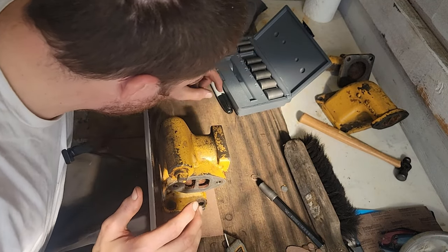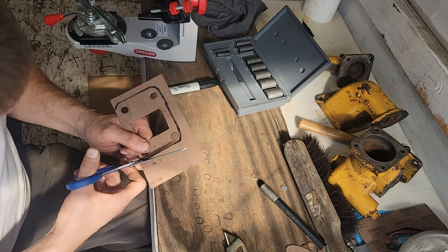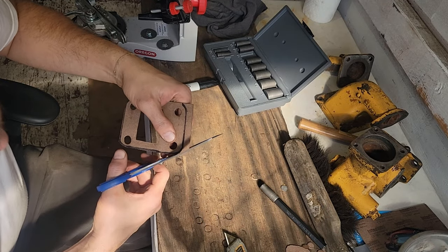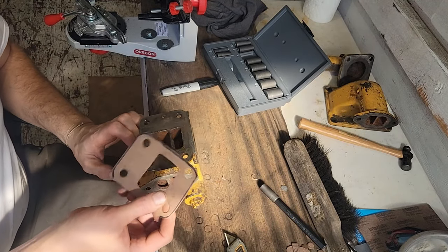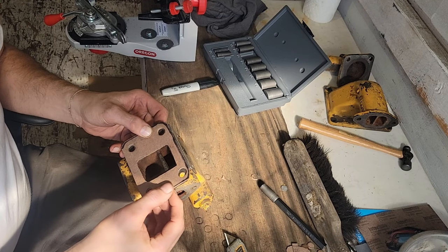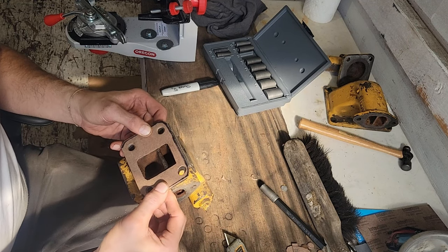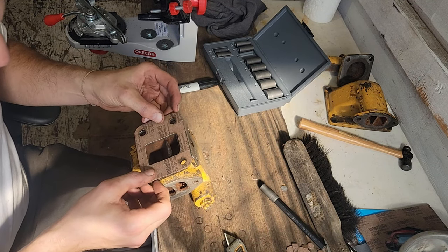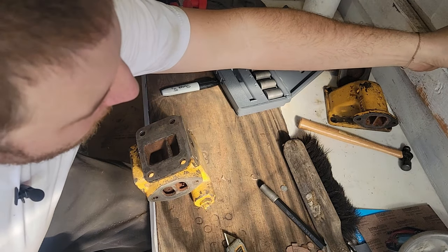Draw the holes all lined up. Okay, that should work. Messed up on the holes just a tad, but it'll work fine. Got like 3/8 of an inch cover distance right there, and we have the little 1/4 inch over here. Not ideal, so you've got to be careful it doesn't move when you're punching those holes, otherwise you'll end up with stuff like that. Let's see, I wonder if this side would be better. No, it doesn't matter. And that gasket went right here too, so okay, we got 2 of them made.